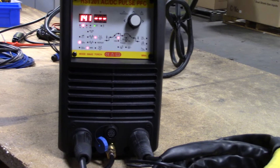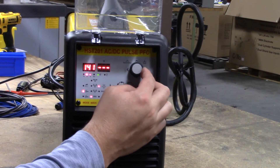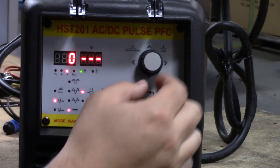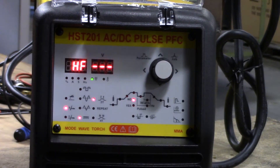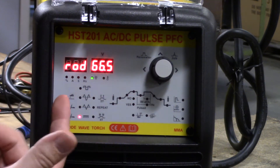As we go through some orientation on this welder from left to right, we'll show you the different modes. We have an adjustment knob that we can go up, down, left, or right for customizations of our weld. An important note for any TIG welding application: we want to make sure and use 100% argon gas for any TIG welding application, no matter the material, whether it's steel or aluminum.